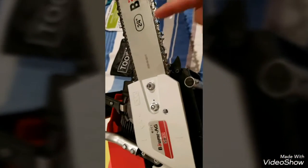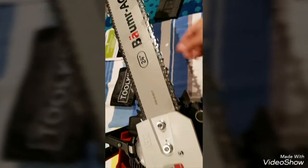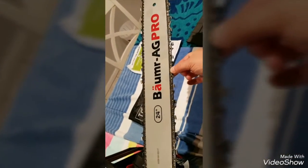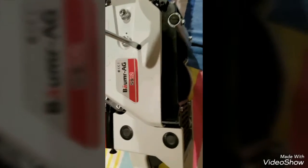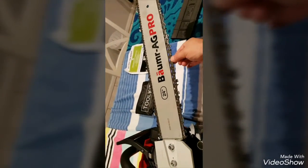When you lock it down, the chain's not going to come loose on you when you cut. I've got the bar located all the way at the top, and I've tightened these down a smidge so they'll hold the bar in place while I set the chain tension. With the adjusting screw tool, we screw it up, lock it in, then test it - grab hold of it halfway along and pull it out a little bit. That's still a little bit too loose, so I'll tighten her up again. Yeah, it's about right there.